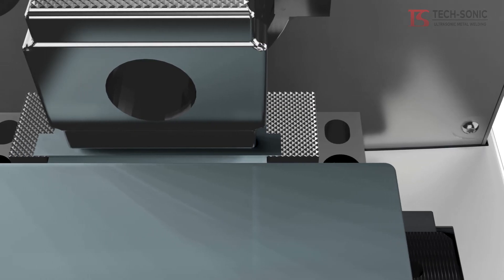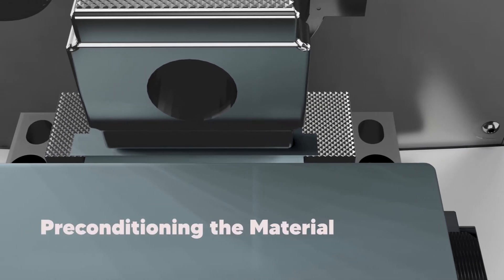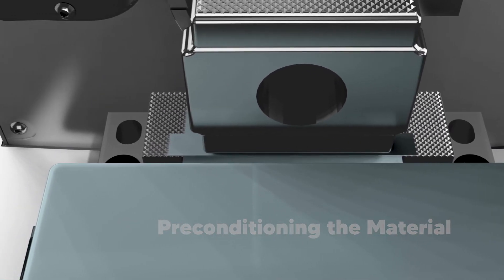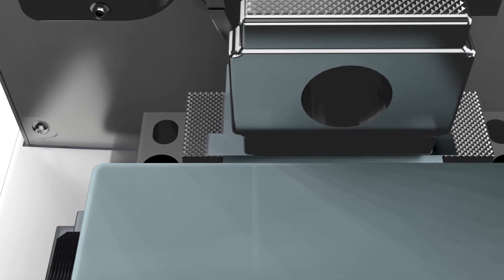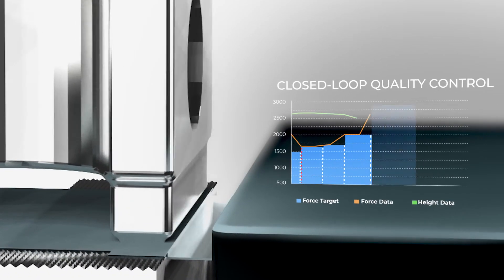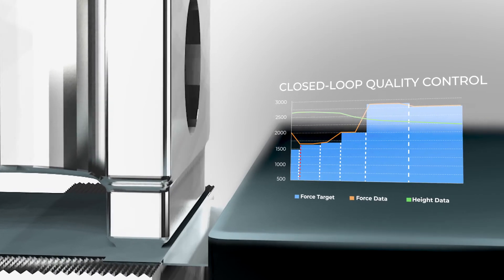In the second step, the material being welded is preconditioned by the active ultrasonics to clean any impurities. Softening the material results in the machine requiring less power. The main welding then occurs with increments of force and changes in amplitude.